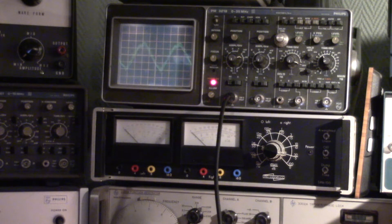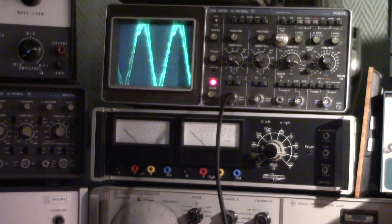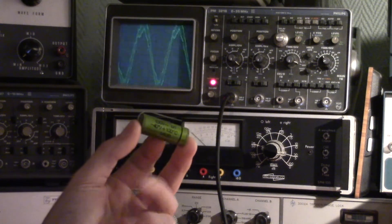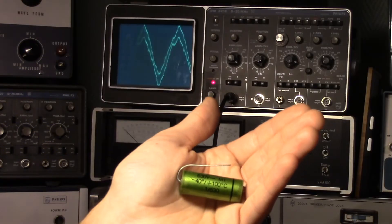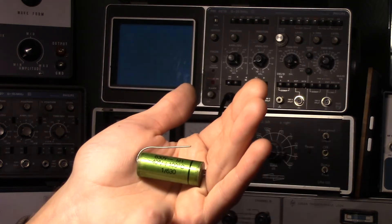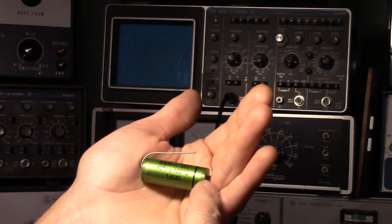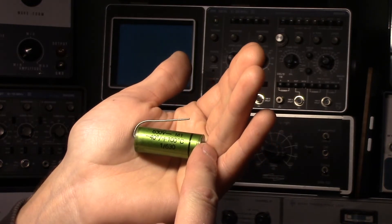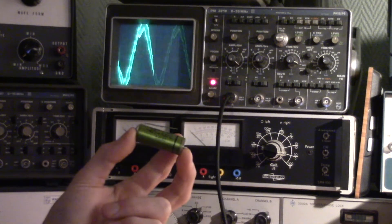So here I am trying to figure out the polarity of the new capacitors, and it turned out to be a lot harder than I thought it would be. Some of them seem to be more or less completely bi-directional. So after questioning my measurement equipment for a while, I went and got one of these old Aero film capacitors that I had laying around. We can see that even though this is a film capacitor, one terminal is clearly marked. This mark indicates that this terminal is connected to the outermost foil, so this terminal should be connected to the lower impedance node.